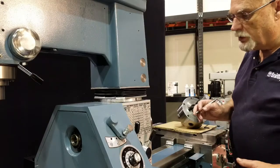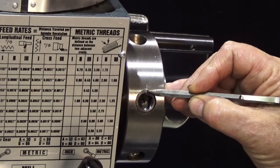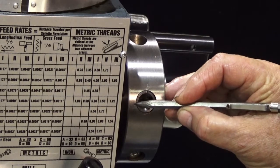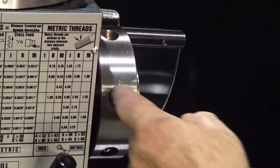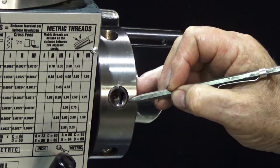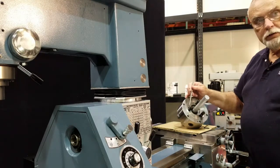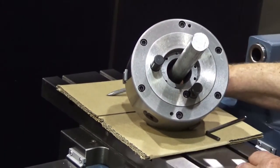When you're installing your chuck or a new chuck, when you turn this clockwise you want this little mark here to be somewhere between this area, anywhere around to about here. You can have two conditions that aren't right: you can have one where you turn it and it moves just a little bit, or you can have the condition where you turn this and it just spins all the way around and never grabs. Those things are compensated for by the screws we have here on our chucks.